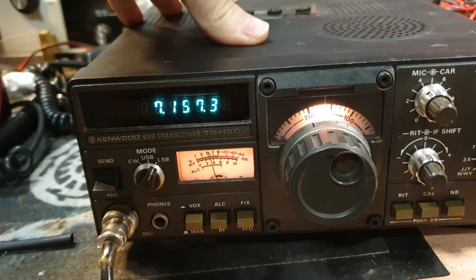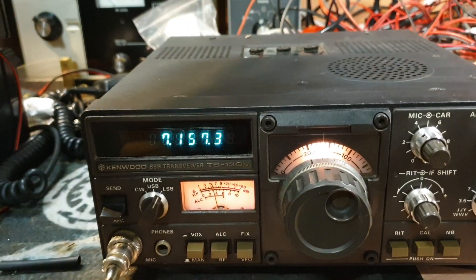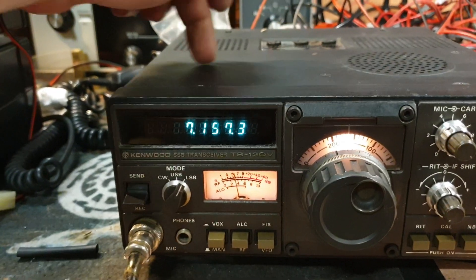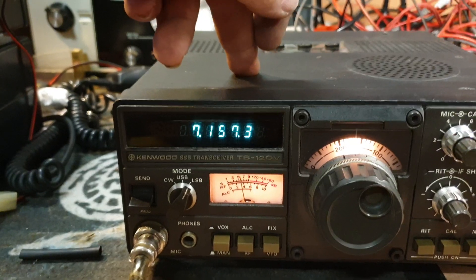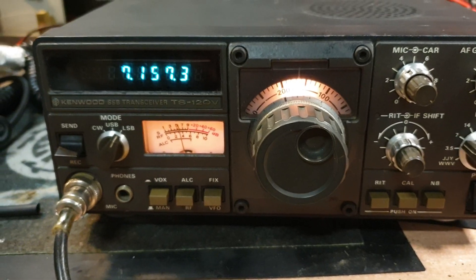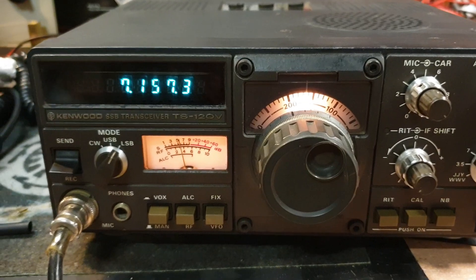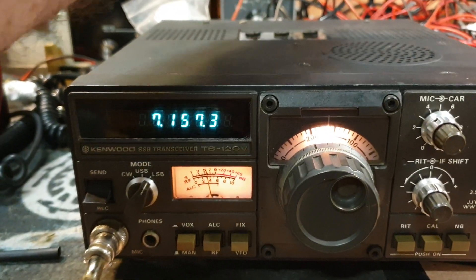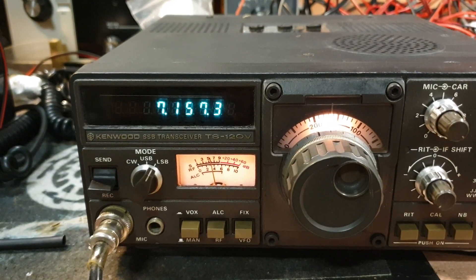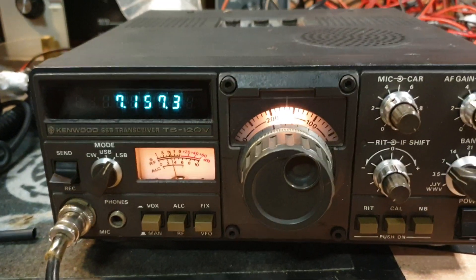There's a lovely little board on here that has four or five little interface connectors on it. Getting it out is basically two screws on the top, one screw on the side, and three screws on the internals where it connects to the chassis. I have seen a number of these over the years and they're virtually 30-minute fixes. Pull the board out — generally it'll be on those connectors: one, two, and three, those three multi-pin connectors, probably about 12 or 15 pin connectors.